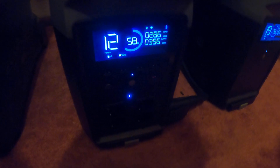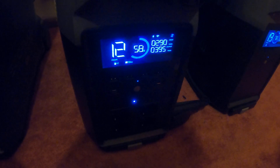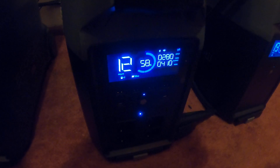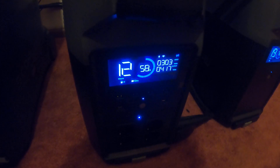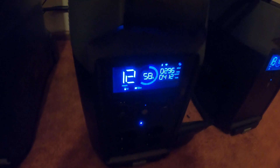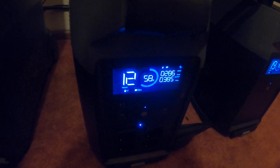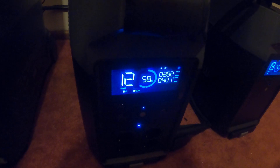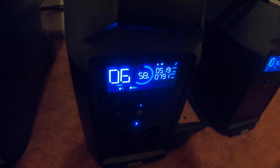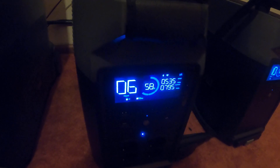I think this is an error from the smart home panel. When the error appears, the smart home panel LED turns red — it's an error red, and it's always the same. The app says it's a battery error, but I can unplug all the batteries from all Delta Pro units and if the error comes again the app still says there is a battery failure — battery one or battery two. So this is really a strange error. I personally think this is a smart home panel problem. I hope you guys can help me.